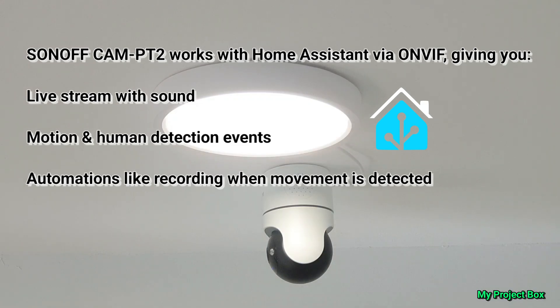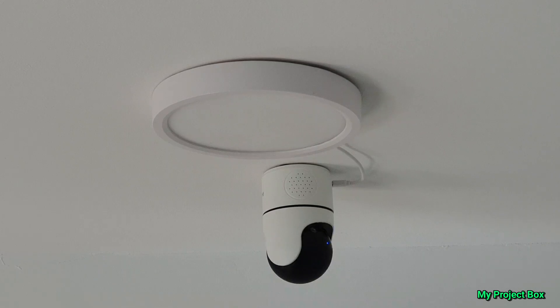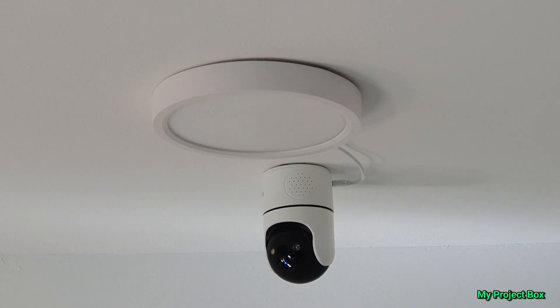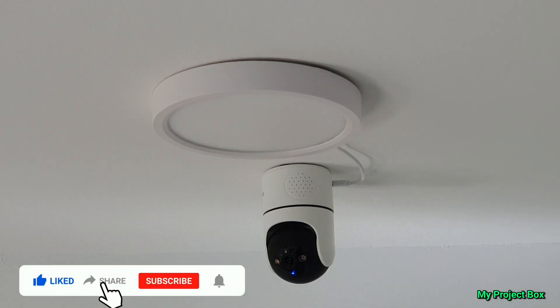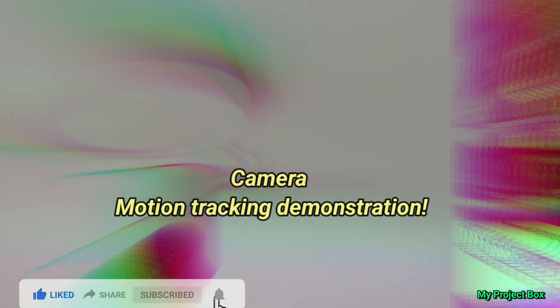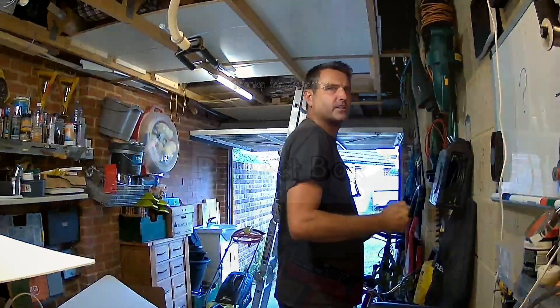Home Assistant integration would also be something that a lot of you would be interested in and Sonoff did send me a complete guide. It did cross my mind to perhaps repurpose my no-neutral circuit but in such a way that instead of providing a permanent neutral supply it now provides a permanent live supply to power the camera, but I think the Basic R4 does a better job of this and as a bonus you get to make that lighting circuit smart as well. Now if you think this is something that would be interesting to see in a future video let me know in the comments. That just about wraps it up - don't forget to like and subscribe if you like these kind of videos, it only takes a second and it really helps the channel out. I'll catch you guys in the next one, thanks for watching.